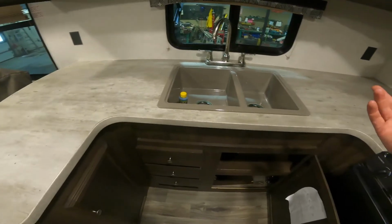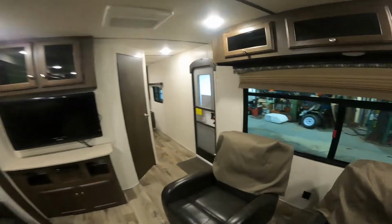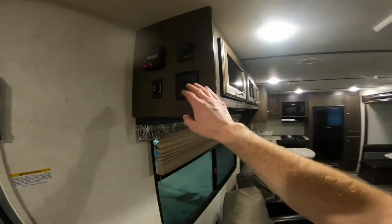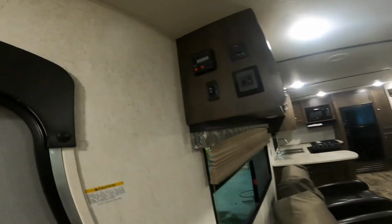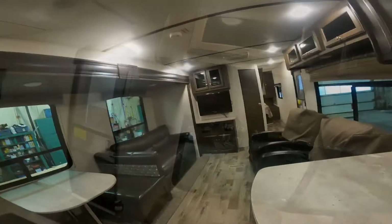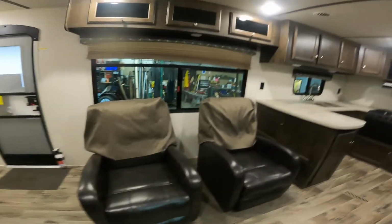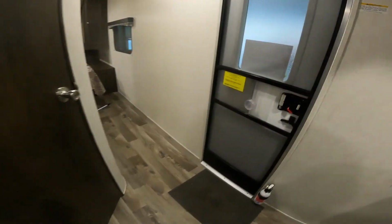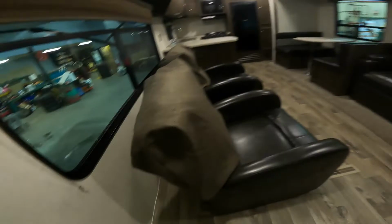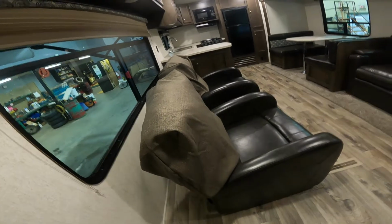Now that you've got everything flushed out and the hot water tank is full, you can also go over to your little connection center here, and your indication panel, and you can click the button and light the gas. So that's the only thing. It's a little different because you guys are taking this when it is still winterized. Just make sure that you're aware of that. But I wanted to give you a quick little synopsis on how to de-winterize. If you still have any questions when you get where you are, don't hesitate to give us a call. Somebody here will be more than happy to help you go through the de-winterizing or anything else that you need for that matter.